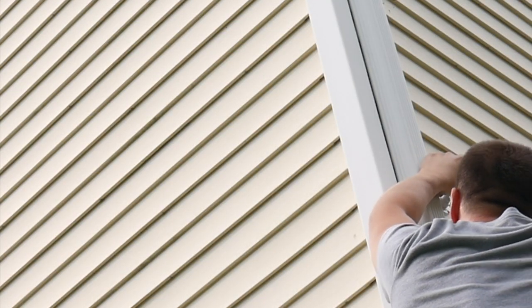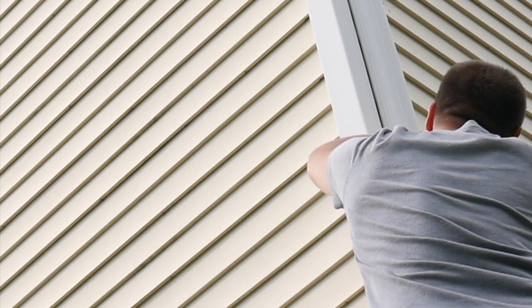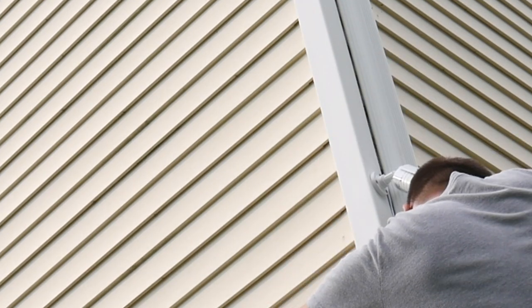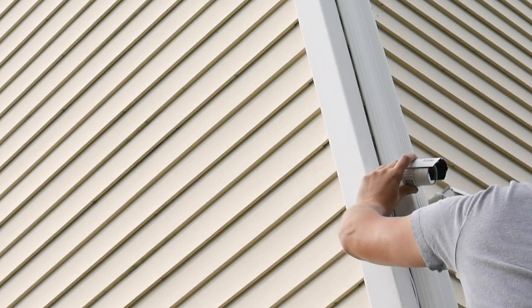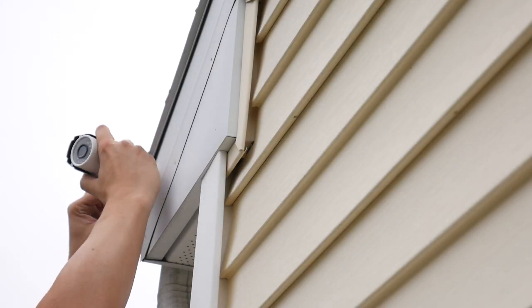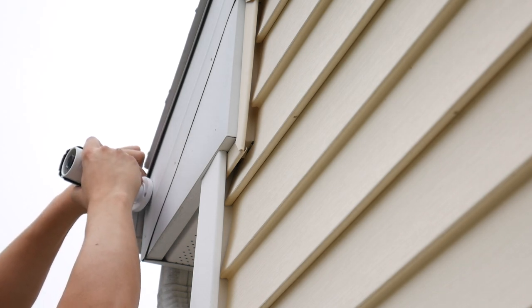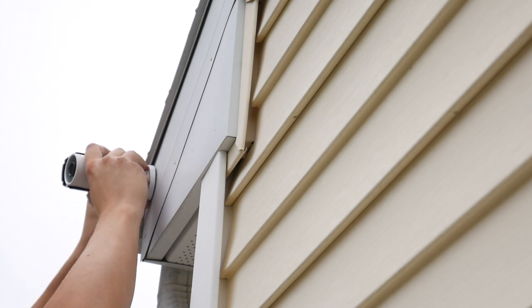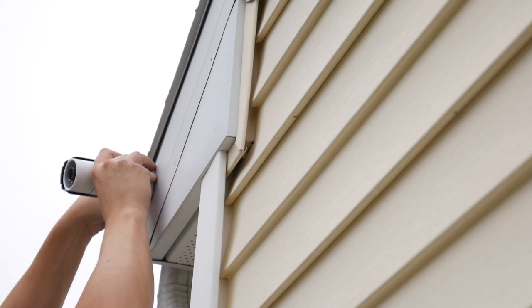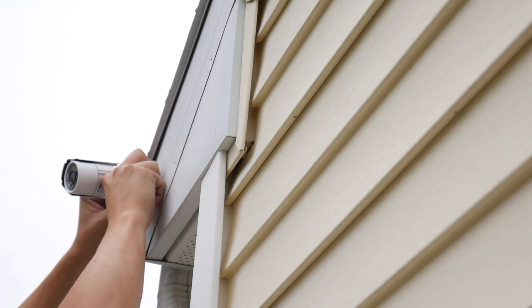So there is one camera that I put there — you can't really see it that easily, but you gotta climb on a high ladder. There is another one that will cover the other angle. I think the smart thing to do is to put two cameras on a corner as much as you can — that way you don't have to take out a lot of vinyl siding. You can run two sets of cables to that corner and have one camera look on one side of the house and the other camera on the other side. Here is a third camera that's on a corner there — this one looks at the road.